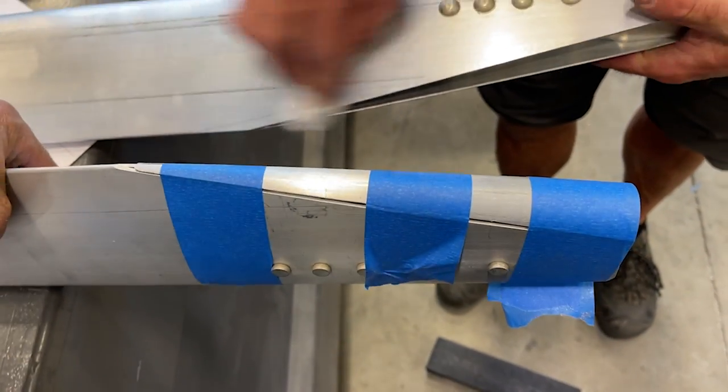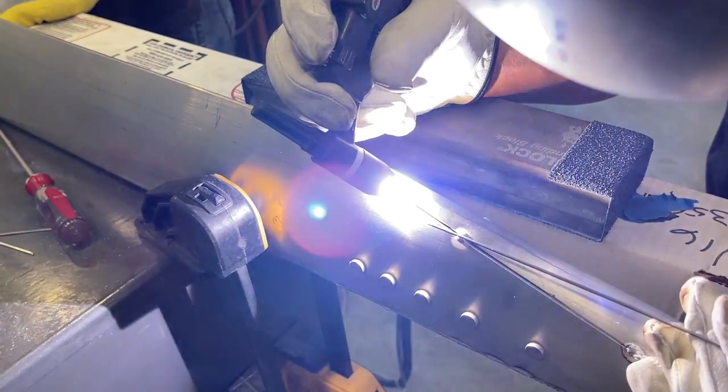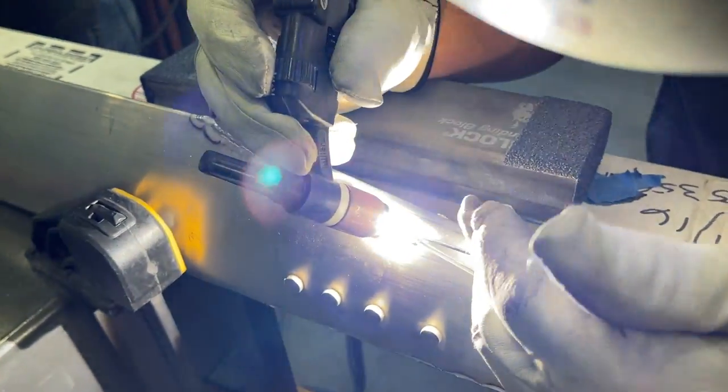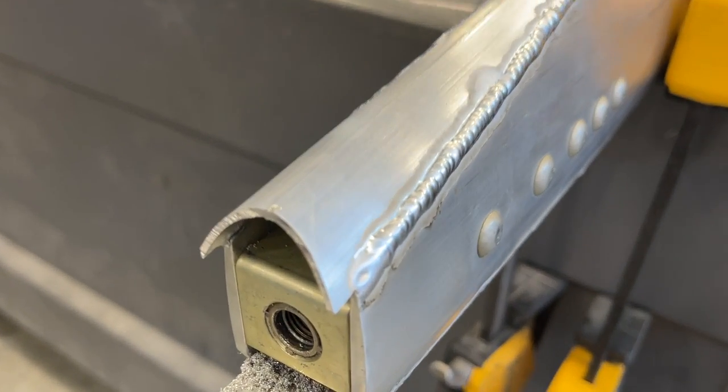What's great is I'm able to use the heavy duty wing struts, and instead of using a rear strut, the main front strut is way overbuilt for what I need to handle, even with Scrappy's loads and weight limits I needed. So I don't need to use anything other than a heavy duty strut on the front. The rear struts, however, weren't quite what I wanted for the loads I'm carrying on Scrappy. So I'm using two front struts and tying them together.